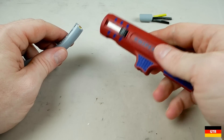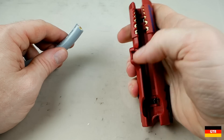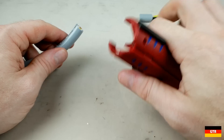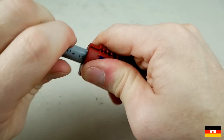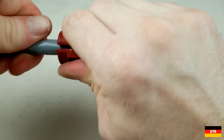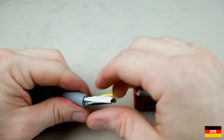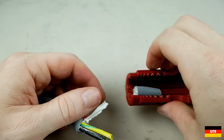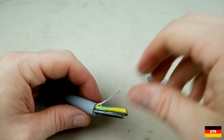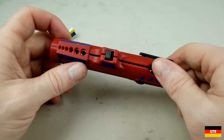So how do these shears compare to a tool that is specifically designed for cable dismantling like this? Using the Knipex 1685125, we first remove the jacket insulation. Since the blades of the cable dismantling tool are intentionally not as sharp as the ones on the shears, it does take a bit more effort to get through the jacket, but it has the advantage that it reduces potential damage to the insulation on the internal conductors. The cable dismantling tool then has a built-in stripper for different wire sizes that is much better suited and more reliable to a novice than using the shears for such a purpose.